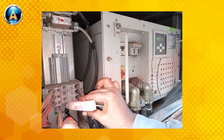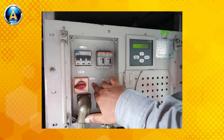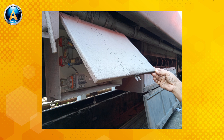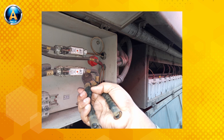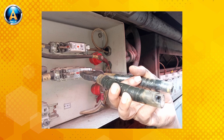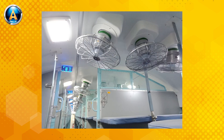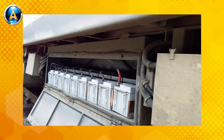Suppose there was power in the RBC — you should press the reset button, but you did not get a solution. So you should remove the positive fuse of the battery, and then press the reset button of the RBC again. And you got the solution. This means the problem might be in the battery bank.